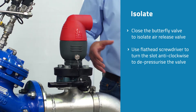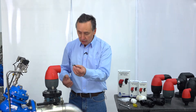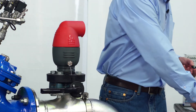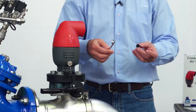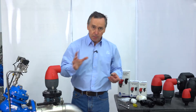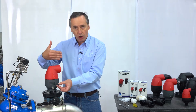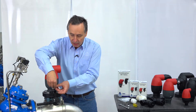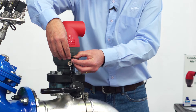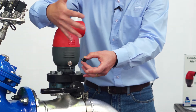If your product doesn't have this optional drain valve, you may have a quarter inch plug fitted into the body. To depressurize, use a 9/16 spanner and simply apply the spanner and turn it anti-clockwise. Very importantly, when taking any plug out of a pressurized valve, make sure you're standing on the opposite side to the plug, undo it very slowly, and wriggle it to release the pressure, then safely take it out so it doesn't spray onto yourself.